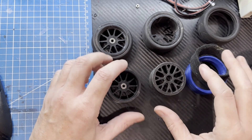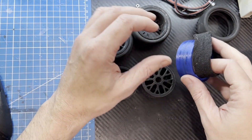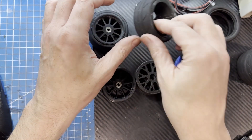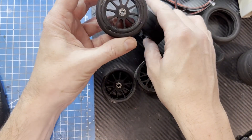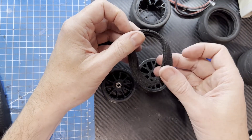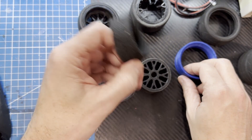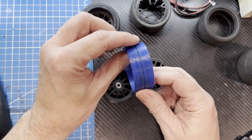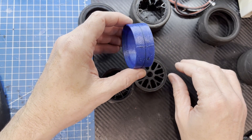Something I've been learning throughout the RC hypercar development process is that tires are everything, especially their inner structure. I tried some stickier tires with version 2 and ran into some of the same problems from day one — the tires suffered from both inside and outside sidewall wear, and the lateral loads were actually tearing the tires off of the rim. RC car tires have an inner foam liner that provides springiness. I learned from version 1 that typical foam wasn't stiff enough, so I printed TPU tire foams about twice as stiff as stock, and unfortunately about 10 times as heavy. But with that one change, version 1 gained over 0.8 lateral g's.